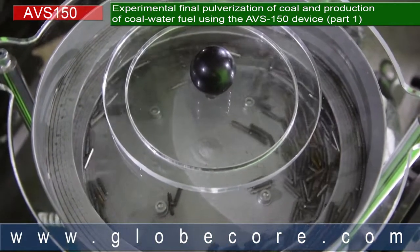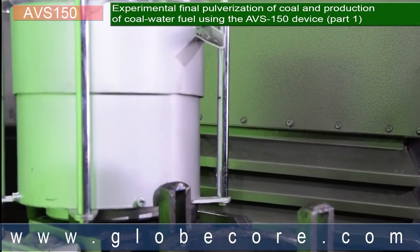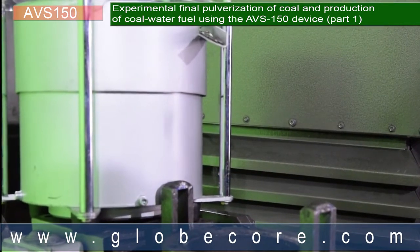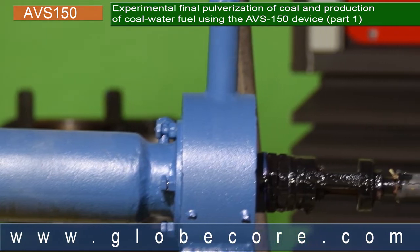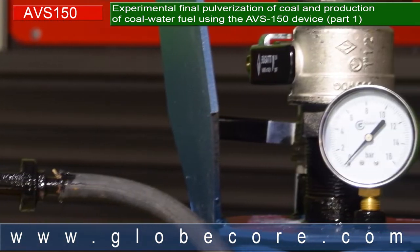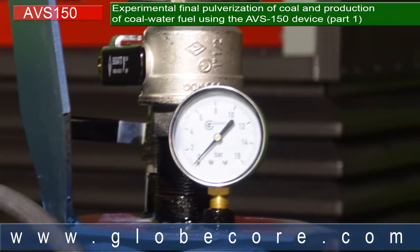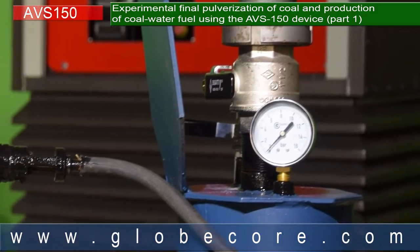Operation of the devices can be made continuous, since additional ferromagnetic particles to replace the worn ones are added automatically by a portioning device. For a more comprehensive research of our product coal water fuel, we constructed a burner with a sprayer. The burner is designed to create finely dispersed particles in a spray to ensure quick evaporation of water and stabilization of combustible gas circulation in the area of combustion.